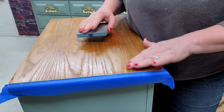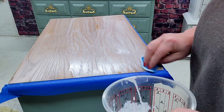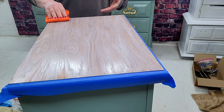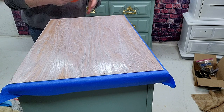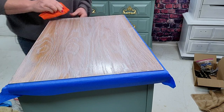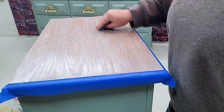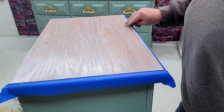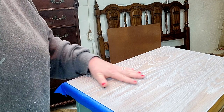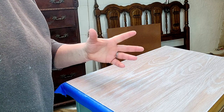I'm just going to sand in between. I may have to do more than one coat, but that's okay. I think this might work. Hopefully we're not going to get pink, but what I'm trying to do is get the red tones out of this wood — that's all I'm really trying to do and get these woods to match. We've done two coats of whitewash on this now. It's not as red, but I'm still not completely happy with it.